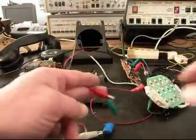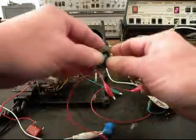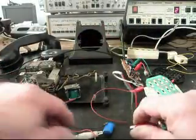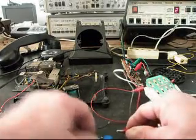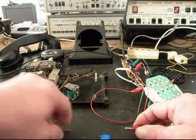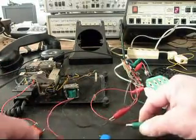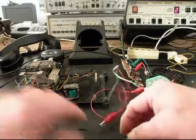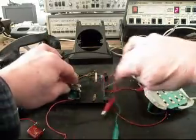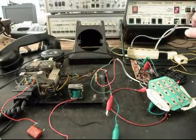because there's no room for a bell, we are going to put in a solenoid. This is not uncommon. Sometimes we'll use things like that in telephones when we don't have the room to use a bell. We'll give you a little test here of what this is going to sound like. Some of these telephones did sound like this from other parts of the country, or the world, where they would use little solenoids.